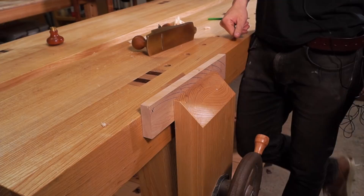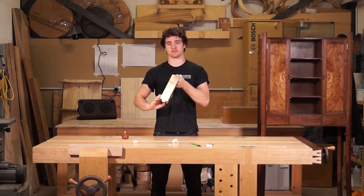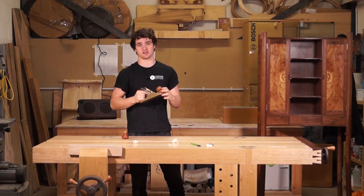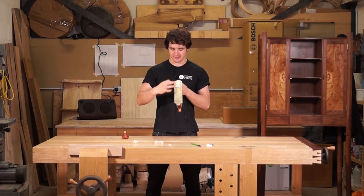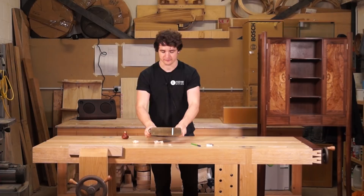So there we go - really not that difficult. Get everything assembled, bring the blade all the way out, check it from underneath, get it square, bring it all the way back in, and then as you're planing along just make minuscule turns of the wheel at a time. The turns you need are a lot smaller than you think. If your eyesight isn't great, run a scrap of timber along the blade - the camber means it takes nothing off the edges but gradually more towards the middle, giving you a good indication of how square the blade is. Have fun making those lovely shavings!